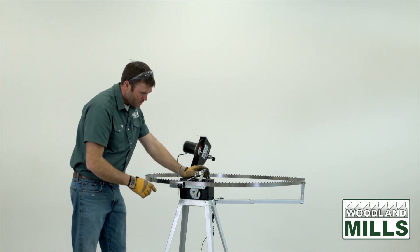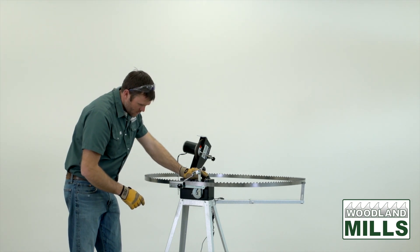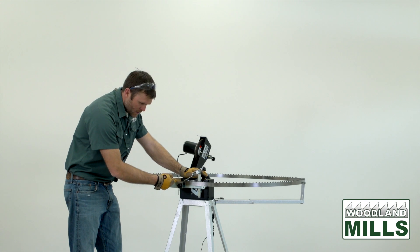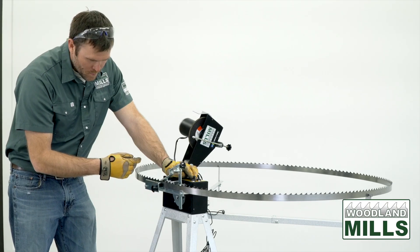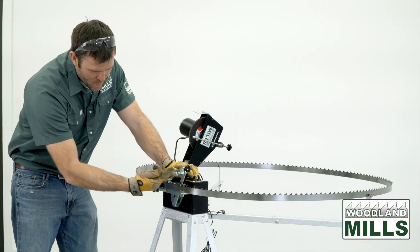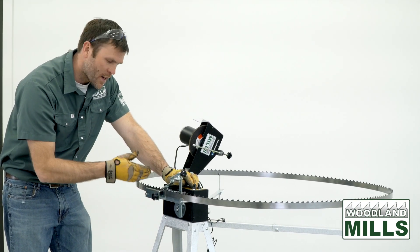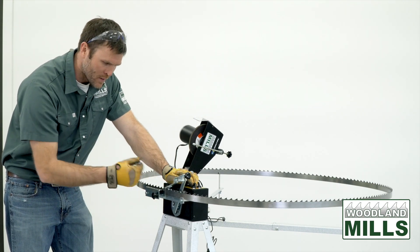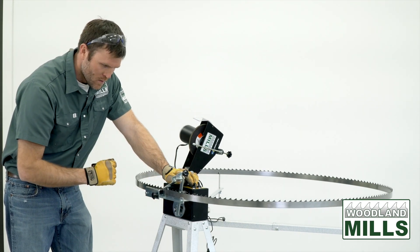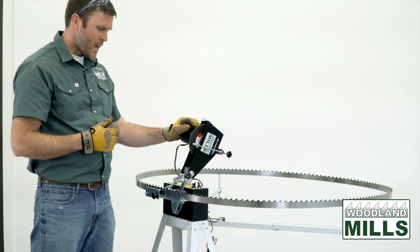With the advancer and its separate control, you'll see how it clicks back over the tooth and pushes it one tooth forward. With this adjustment I can make changes depending on the pitch of the blade I'm working with. This happens to be a 7/8-pitch blade, and then we can start to bring the grinding head down.